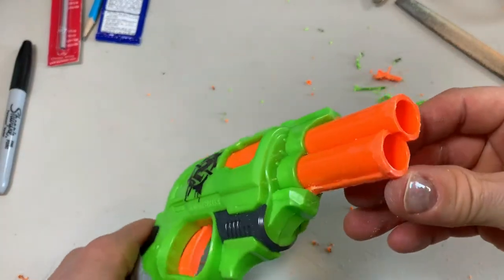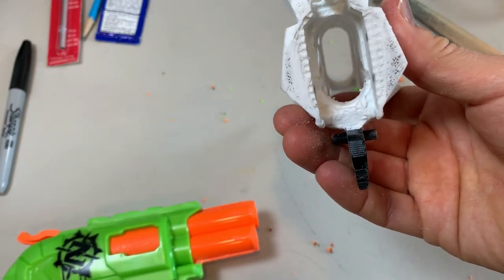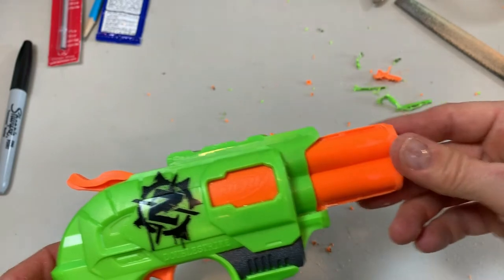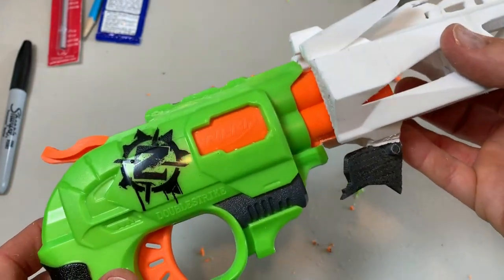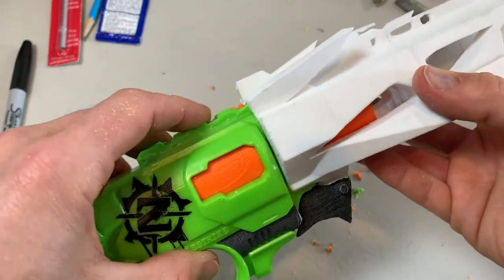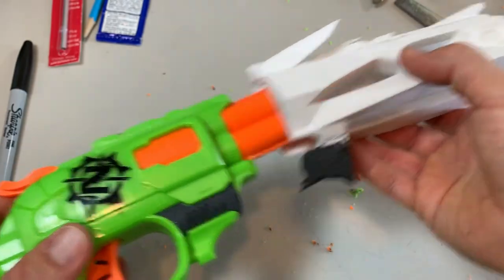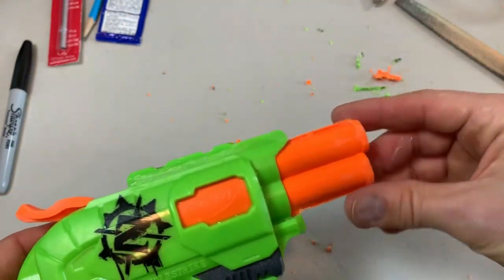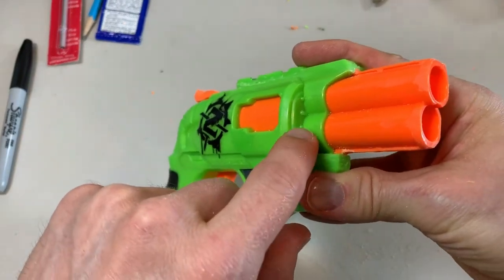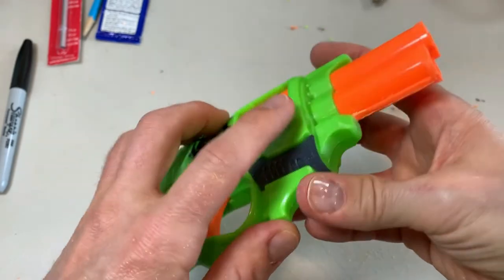I went ahead and sanded off and had to round off the ends here as well. Basically what you're going for is mimicking that oval shape of the insert — that is what you're going for on the end of this barrel so it slides in easy. Take care to gradually sand little by little because you want a tight press fit. Also, these one, two, three little bumps on the back keep the barrel extension from fitting nice and tight and flush against the cylinder portion, so you're going to want to sand those off too.